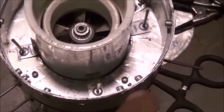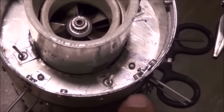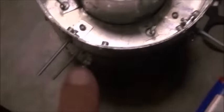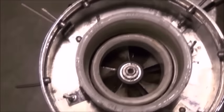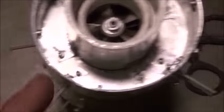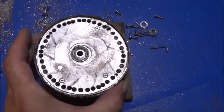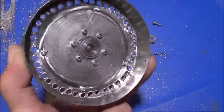We've got our lower disc in there — the one that sits as the top plate to our diffusers. I've got the L brackets riveted into place, riveting from the lower disc to the outer wall to our spacer disc and through, then down to that lower disc. I'll do some fill-in work around the edges to make sure all the air gaps are filled in, then set our top disc on there. Here's a quick shot of the diffuser plate — I just got done drilling all the holes. This is where the air from our compressors goes into the combustion chamber.